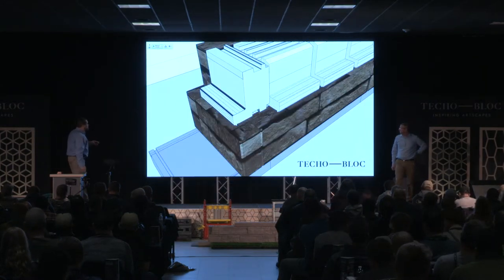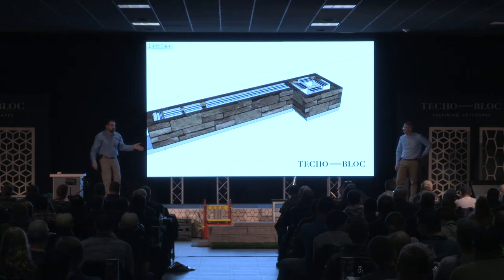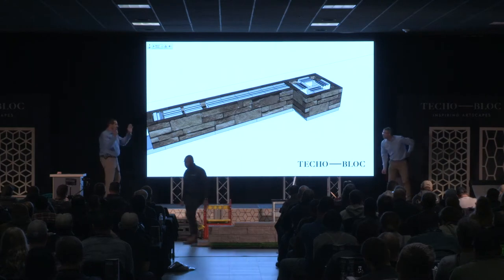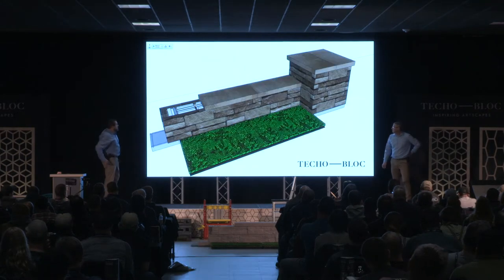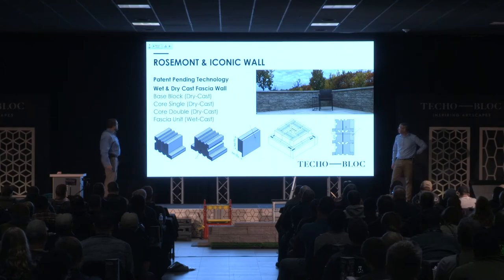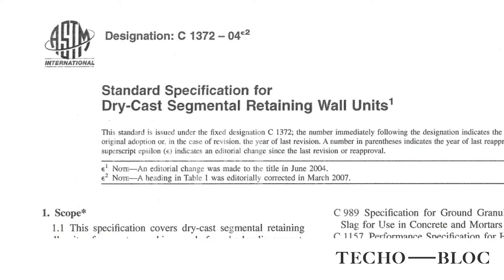Here's our first row in, and the first row of that pillar also, which we recommended building solid. You see those half pieces installed there. The next course — tabs are lined up — second course, and then you see the pillar, we have those openings. Would you fill those with clean stone? Not really — water's going to get in there, it's going to bring stains out of it, it's not even worth doing. Don't do it. Then we have our pillar going in and the turf installed up front.